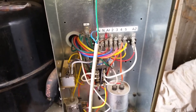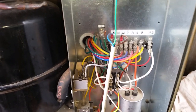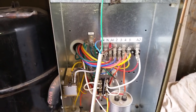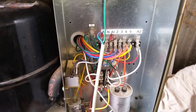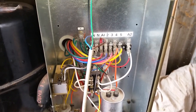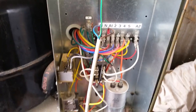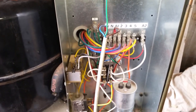I'm not going to tell you not to wire things up yourself, because clearly I do, but you should have a working understanding of how electricity works, how it propagates through a copper cable, what electricity basically is. If you can't answer that question, you shouldn't touch any electricity, including low-voltage DC batteries, which can put out a lot of current. Keep in mind also that 240 volts is what we're supplied with, but it's actually not — the keyboard warriors are going to get pissed about this — but it's about 340 to 360 volts peak.